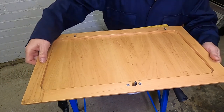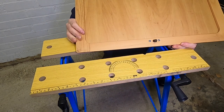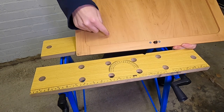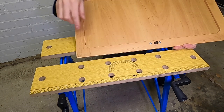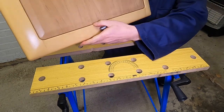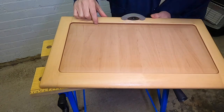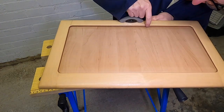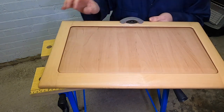As I push the panel out, the pins are actually going straight through this panel here and making a little hole. You can actually see that's why this crack is occurring — it's pulling the veneer. This piece of veneer here is still attached because the pin is in place.